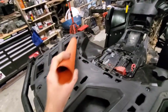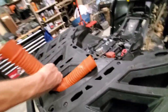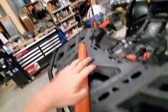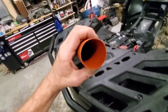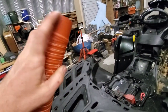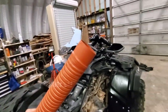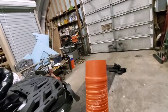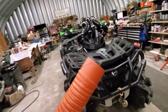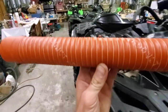I ended up using this tube here, which is military grade two-inch flex tubing. Look at that — it's insulated, it's bendable. I looked it up on eBay. It is actually two inches inside. What you do is slide a piece of two-inch pipe over the top of this, put glue all over it, slide it on, glue it down, let it dry overnight, and then you can put any two-inch 90, 45, whatever you need right over that pipe.